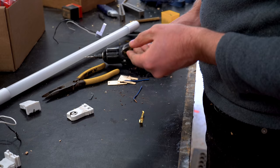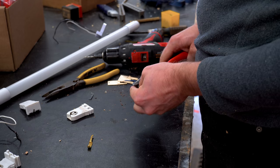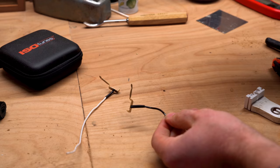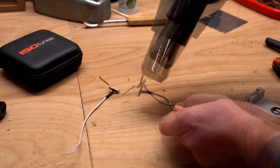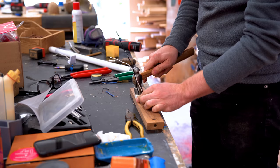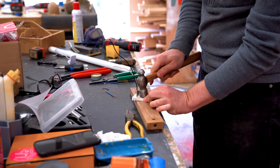After trimming it, I realized that the brass pins were gonna stick out the front, so I trimmed off a little bit of those, and then I soldered wires to the back side of them. They actually already had a hole in them, so it was super easy to solder them, and just to make sure that things were safe, I shrink tubed any exposed sections of copper. After that, I just reassembled the tombstone and basically works like normal. It just has wires that come out the back.